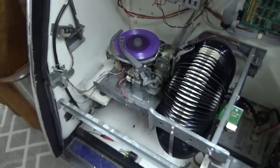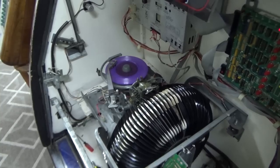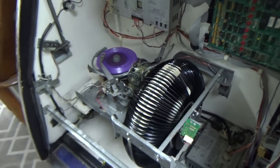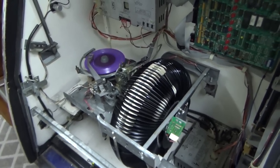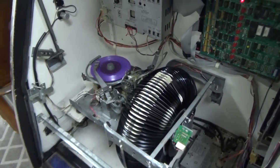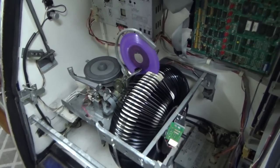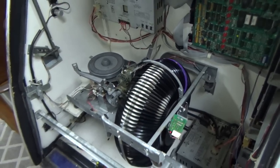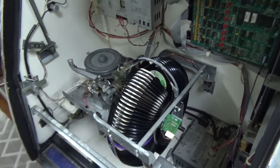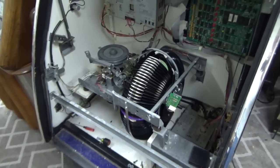Two, one, two — just looking for it. Everything seems to be cool so far. Went through the A-B switch. It has selected a record. That's a dirty record — thing's filthy. When it eventually gets to the end — there it goes. Oh yeah! It's like butter, people. So if you get that problem where it won't reverse, it could be a lot of things, but it could be that switch.